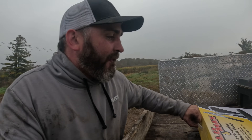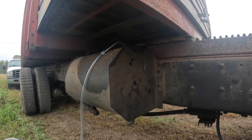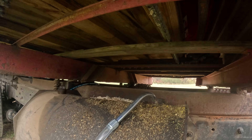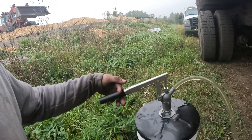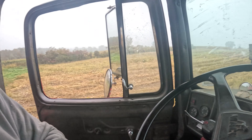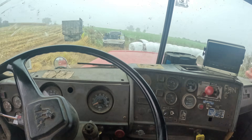It disappeared in the move. This tank was put on at some point, probably with the manure system. It is very challenging to get in to fill it with the box on, so this is the only way to do it. We'll put five gallons in it — hopefully that's enough. New lines on, put a new radiator cap on — the bottom gasket, the sealing gasket, was actually gone. That's probably why we were losing coolant over time.